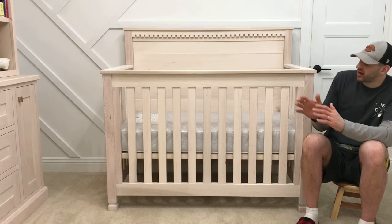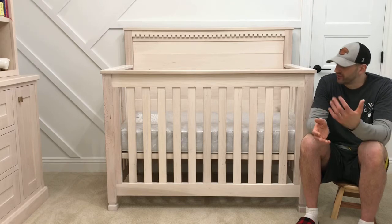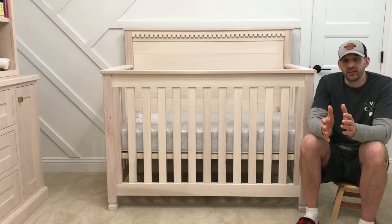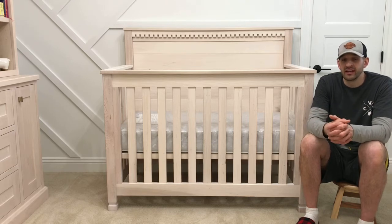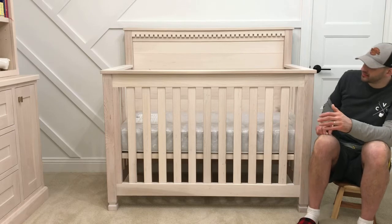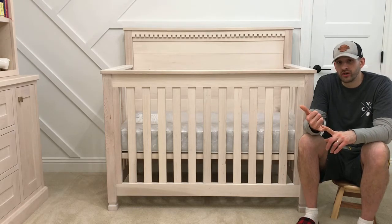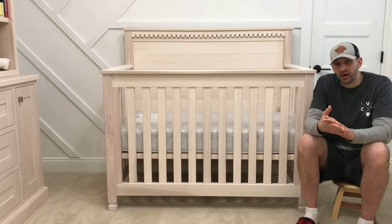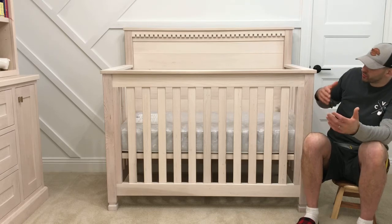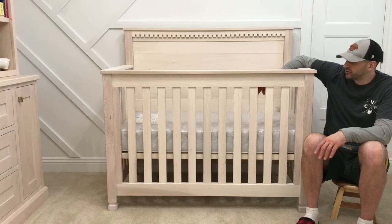For this project, I mainly used the Festool domino joiner to secure everything together, but there's many ways to do that. If you don't have the domino joiner and don't want to invest in it, which is understandable, then you could use traditional mortise and tenon joinery. You could do biscuit joinery. You could use dowels, pocket hole screws. If you're gonna use pocket hole screws, you might wanna do it from the backside and plug them so they're not gonna be as noticeable.